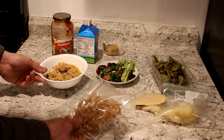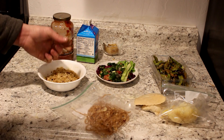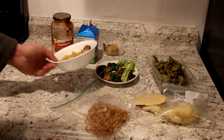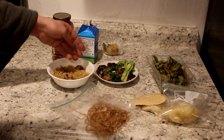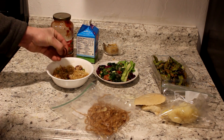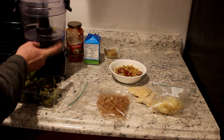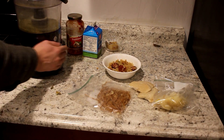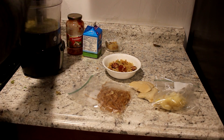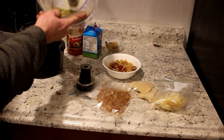Things like this can't really go into a compost pile — it'll really stink. You can't put meat in a compost pile; it'll attract critters and it doesn't really compost well. But that's in an aerobic environment. The anaerobic digester — first of all, you're not going to get any smell out if you've got it well sealed. Also the conditions inside and the bacteria are able to break down meat and oils much better than an ordinary compost heap. Soybean husks would be very difficult for my artificial cow stomach to break down, so I must employ some artificial teeth. Okay, there's the soybean husks ground up. I'd like them to be a bit finer but they are quite tough, so it's probably good enough.